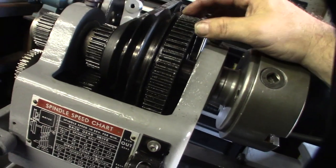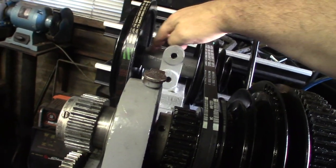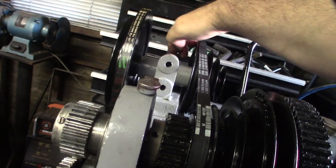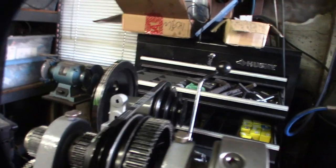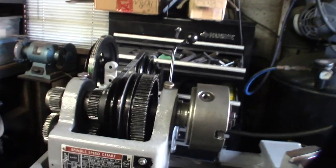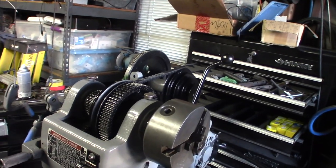I figured what will happen is the oiling from here — it comes out the side — there's no place to go, so every time I oil it, it's going to leak out and lubricate the thrust bearings, and I can quickly oil it like that. I haven't even run this yet so I don't know if it's going to make a difference or blow up the machine.